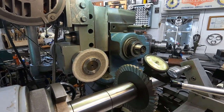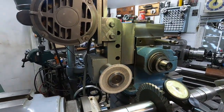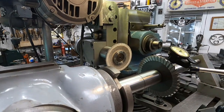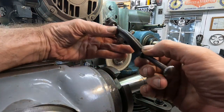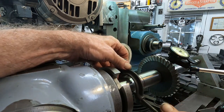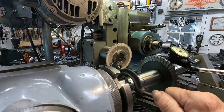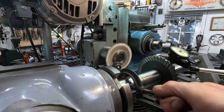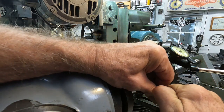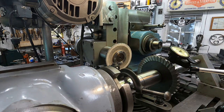I've got a set square here and I'm going to dress the wheel. I hope you're all doing good. I've got a dresser here — I locked this shaft and I can just clamp this right on here. I just want to lightly dress that wheel. Nice and snug. I should have good clearance to do that. I'm going to fire this up — it turns about 5,000 RPM.